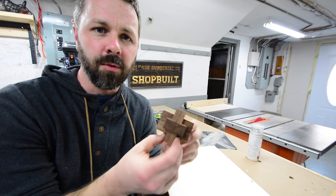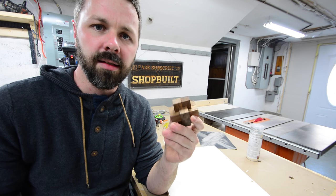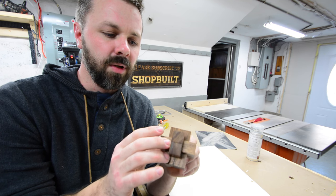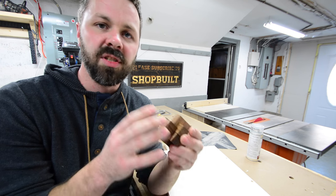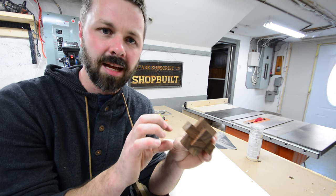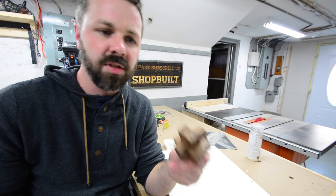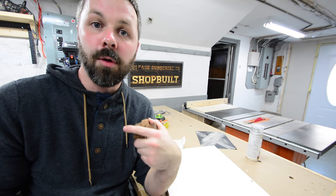For a finish all I did was just give it a couple coats of spray lacquer. It was a pretty fun project. Admittedly I didn't get this the first try — I think I underestimated how difficult this project actually is. Where I went wrong the first time was I didn't pay close enough attention to how centered my dados are in the blocks, as well as that they're exactly three eighths of an inch or exactly half the depth of the block. And the first time I didn't use the bench setup, and I think that's really what gave me the accuracy I needed. Anyway, I hope you guys like this project — I'm Ryan Oslo, thanks for watching.